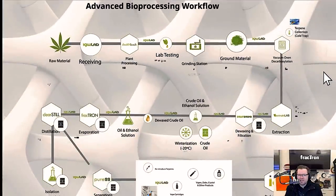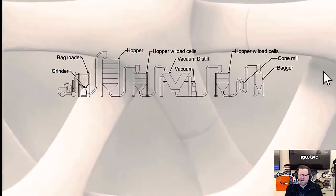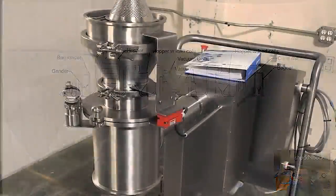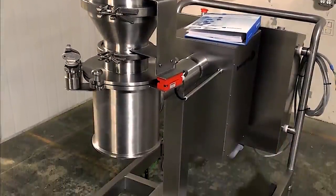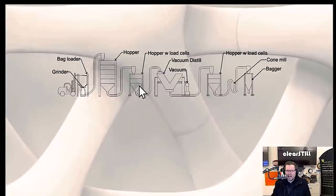Now I'm going to talk about grinding. If you're doing like one to two tons a day, you don't need a huge system — you would use a smaller grinder in combination with another grinder and a vacuum still. However, if you want a more automated process or you're doing three to five tons per day, we recommend a more automated process where super sacks are admitted to the grinder system by forklift.